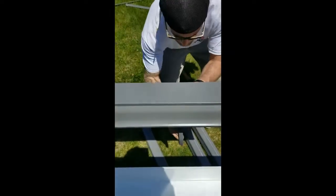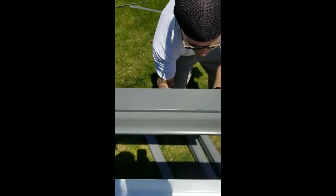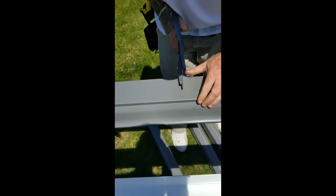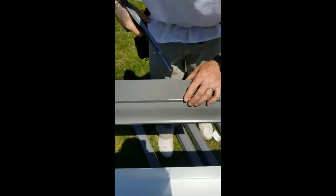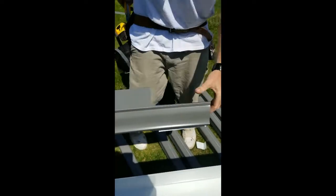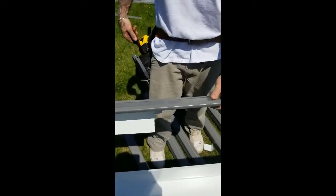Cut the first line. Second one's a relief cut straight across to the bottom where the miter ends. Score and break this bottom piece off and get it out of the way. Then cut up the contour.